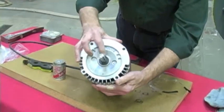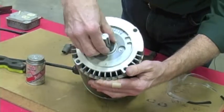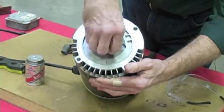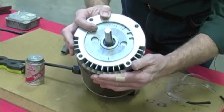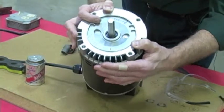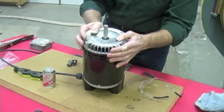If your motor comes shipped with a black gasket on the shaft, remove the gasket. It's a rubber gasket, and that gasket will degrade — it may even smoke when that shaft gets hot. The shaft runs in the exhaust stream, so we don't want that there.